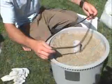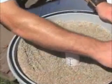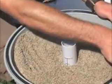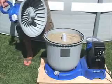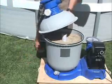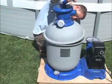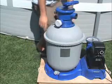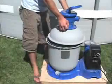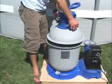Place the tank O-ring around the top edge of the tank. Make sure no sand is trapped in the process. Lower the 6-way valve cover over the tank, making sure the bypass pipe under the cover fits securely into the center pipe. The tank O-ring must be carefully aligned also. Check again to make sure the filter outlet faces the pool.